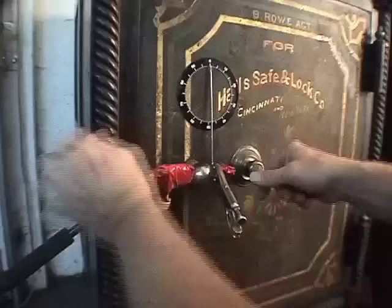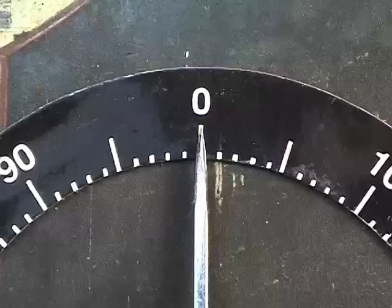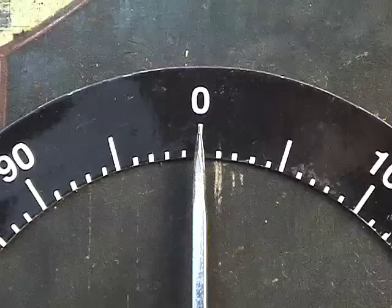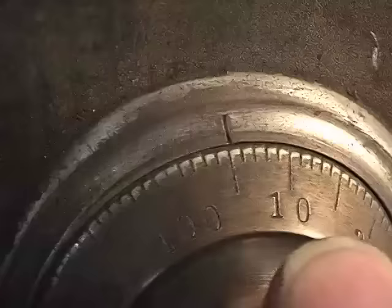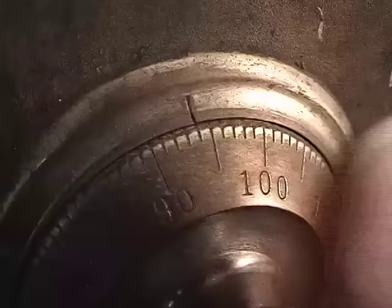Let's begin. I want to look for the best reading among all the false gates — that's the reading I'm going to use. It doesn't matter if it's a true gate or not; I just want to find the best reading of the driver gate. When that needle moves to the left, that's a better reading, and right there it looks pretty good. Going to the next one — it's back to a high reading. So it looks like I can use that one number as our start number. That was 30. I'm going to check it again going in the other direction — coming around to 30 — and yes, the pointer is to the left of my zero. That's the number I'm going to park my driver gate at throughout the process.